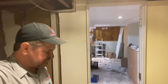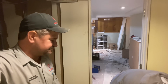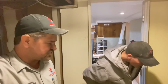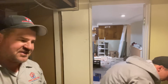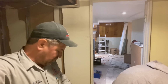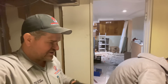On Sunday morning, I'm looking for a couple of volunteers that want to help me do a great deed for a family in need. Part of the Mikey Pipes philanthropy organization is where we provide free or low-cost plumbing, heating, and cooling services to those in the community who can't afford to hire a professional, right? I need some help on Sunday morning. The homeowner doesn't know yet, but we're going to take out a failed Burnham SIN4 gas-fired steam boiler with a single header coming out the top. I'm almost positive single header. And I have the boiler in the shop. We're going to replace the boiler.